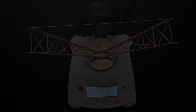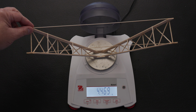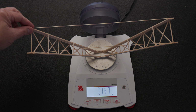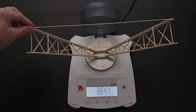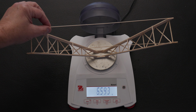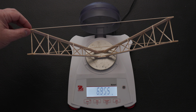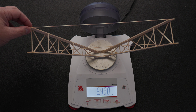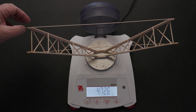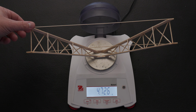It's really important to know the mass of your device accurately before going into a competition. One reason is that sometimes the event supervisors or helpers don't know or follow the rules for weigh-in. I have unfortunately heard of cases where the supervisor actually touched the device to hold it steady during weigh-in. This is obviously extremely bad, as they are never supposed to touch it at all, but it can also lead to very inaccurate readings. Here I am touching the bridge as lightly as possible, and the readings are all over the place.